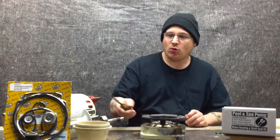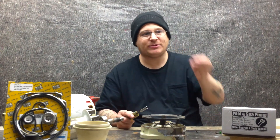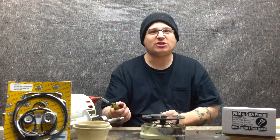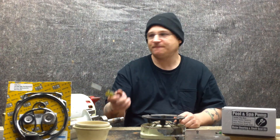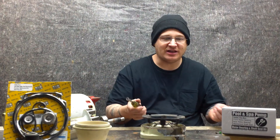After that, what I'm going to do is I'm going to start reinstalling the armature inside of the front end bell and I'm going to clip it down with the bearing clip and then my front end bell will be mounted to my armature. Then we're going to put the armature into the vise and we'll show you how to reinstall the armature and everything else like that.